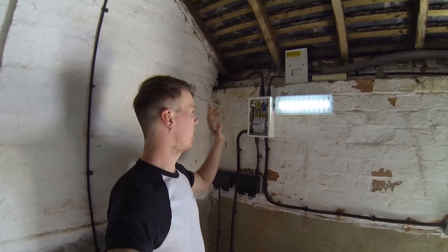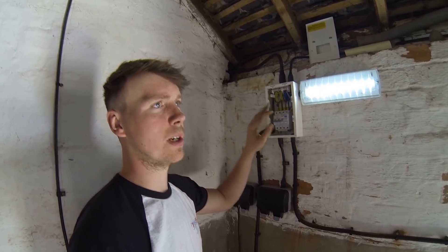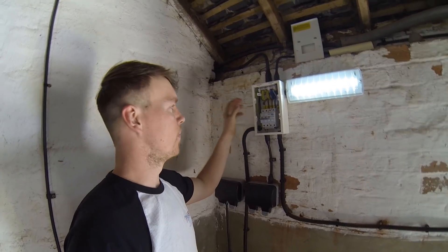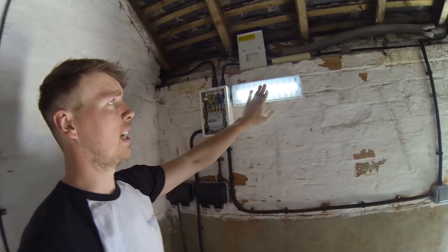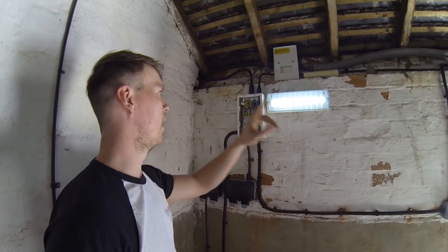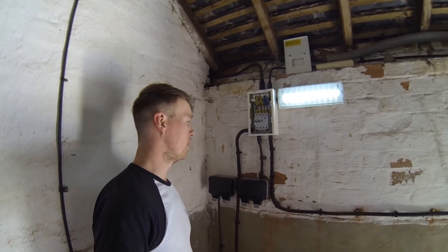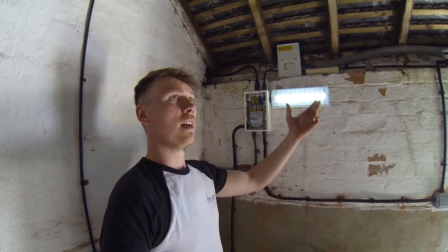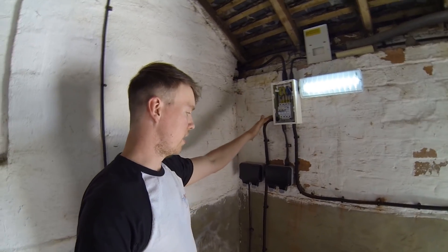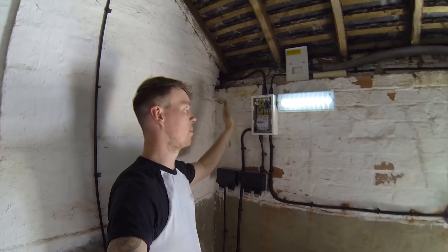The board's on and wired up. We have a 40-amp 30-milliamp RCD here - because it's run off another board, I want to lower the amperage to make sure this trips before the main board if it's inaccessible. We've got a 32-amp type-B breaker for the sockets, 6-amp type-B for the lighting, and the emergency light's on. It's a PME system, run off PME from the main farm. Because this is a distance away, if we ever got a loss of neutral at the source and still have live, there's no earthing around here. So I've put in secondary earthing - an earth spike in the ground - just in case the worst case happens and there's no earth, so the RCD will still trip. That'll be tested separately to the main earth as well.